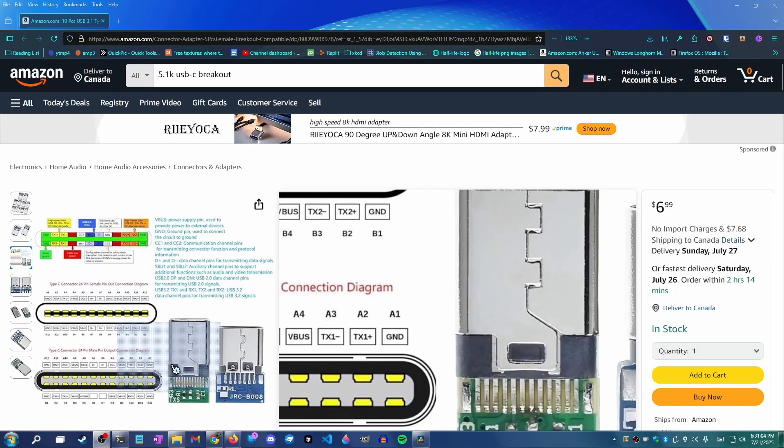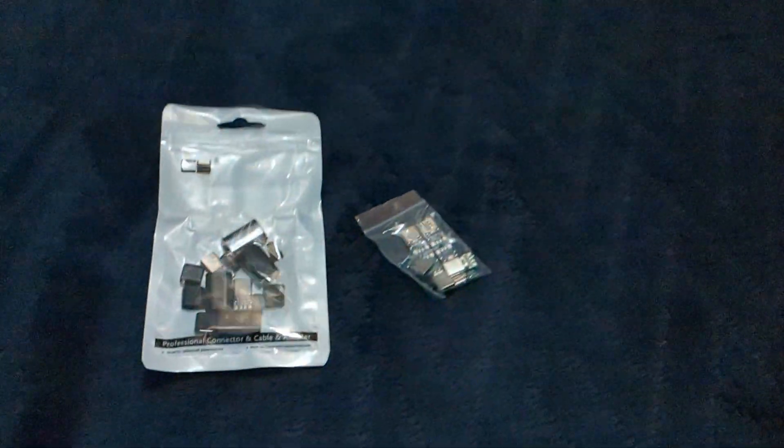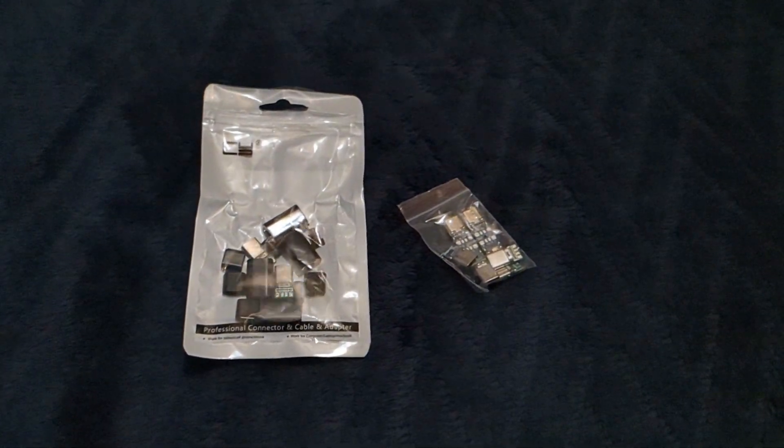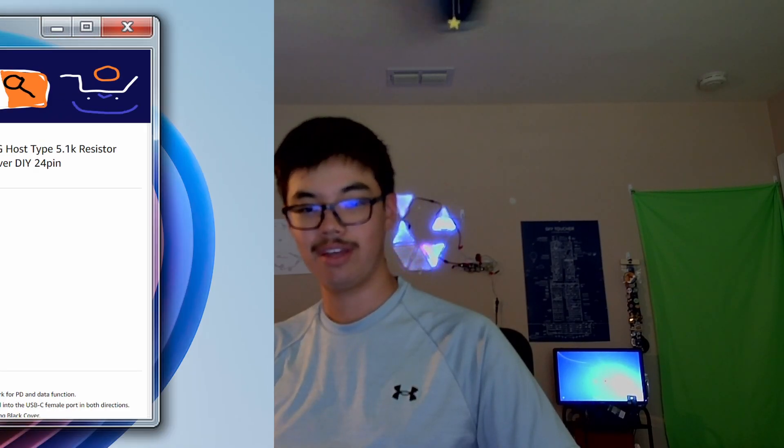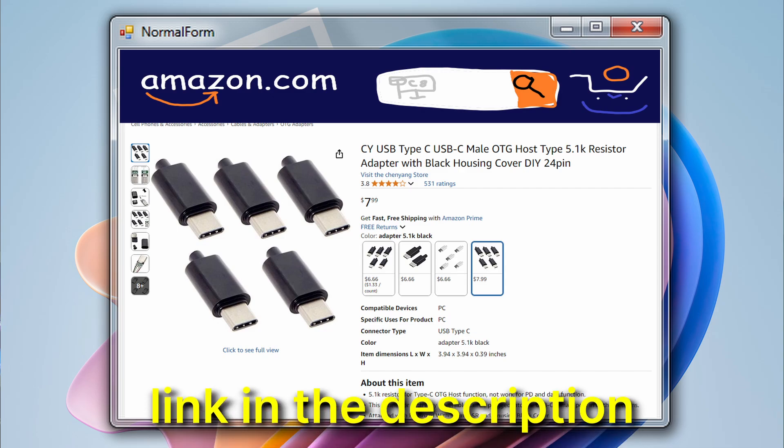I had to go back to Amazon. Remember when I was talking about how I didn't want to buy USB-C ports from Amazon? Yeah. This was a lot of annoying research, especially because in some listings each of the photos showed different plugs. I eventually bought two sets, figuring if the first didn't work I could use the second. After soldering the new connector, everything worked perfectly and I could keep revising my design. If you're looking to buy some yourself, in general you'll want to look for ports that advertise OTG support or have a 5.1K resistor — bonus points if you can get both.